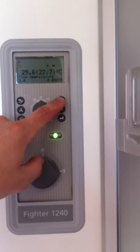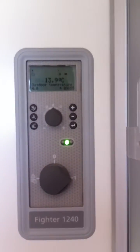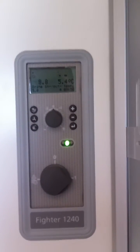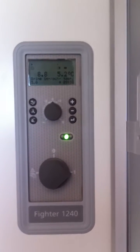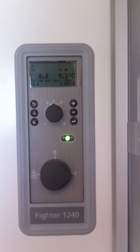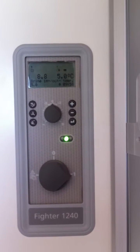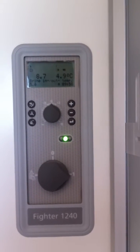If I press plus or minus I'm going to toggle through the menus of the heat pump. If I press plus I can see my outdoor temperature — currently it's 13.9 degrees. I can see my brine in and brine out. These are the temperatures coming in from your collector area outside, be it wells, lake, or horizontal collector. So it's coming in at 8.8 degrees and going out at 5.1 degrees, giving us a delta T of roughly 3.8 degrees. You're always looking for a delta T or temperature difference of about 3 to 5 degrees.